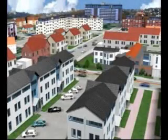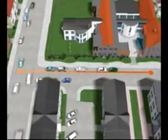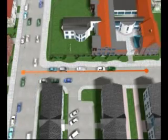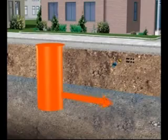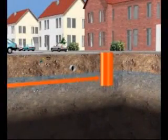The following sequence shows the laying of a 400mm diameter sewer in a residential area using a Bortec BM400 with double-walled pilot rods and groundwater auger. The sewer is to be installed 4 metres below ground level and below the groundwater table from a working shaft of 2 metres diameter. Traffic is unaffected and the new line can easily pass beneath existing surfaces. Damage to the roots of trees and bushes is avoided by the use of this method.